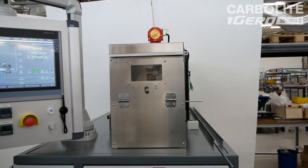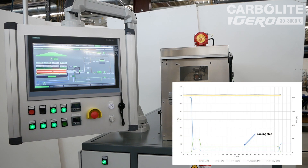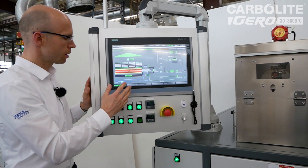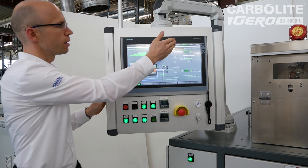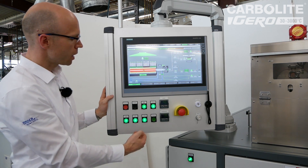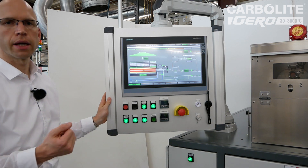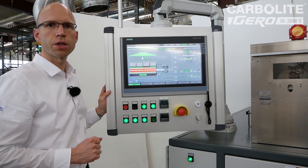Now I start the cooling process. Again to show it here, I have a cooling process of only one minute, but depending on the process and your samples you can set it as long as you want until you are sure the sample is cold. Remember, this cooling takes place in full hydrogen — we have 400 liters of hydrogen and 100 liters of nitrogen per hour. This is the advantage: annealing in hydrogen and cooling in full hydrogen. Before we can open the furnace and take out the samples, we have to do a flooding step again to ensure there is no hydrogen inside anymore.